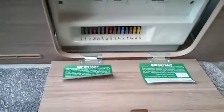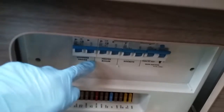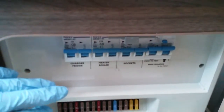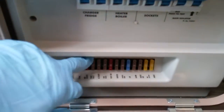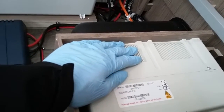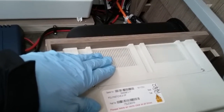We have the consumer unit just here — flap the front down to see the mains trip switches along the top: individual MCBs, main RCD, and test button. If anything is not working on mains supply, just check to see if you've tripped. If something is not running on 12V, check to see if you've blown a 12V fuse just down here — they are all labelled. On the top is where the battery charger is located, so make sure that area has some ventilation to avoid overheating.